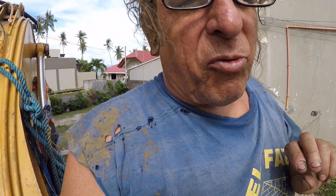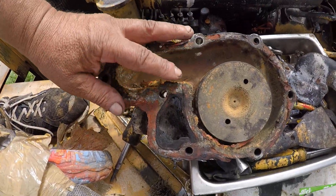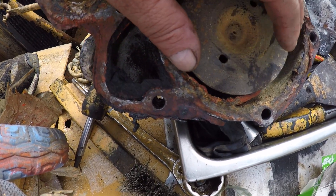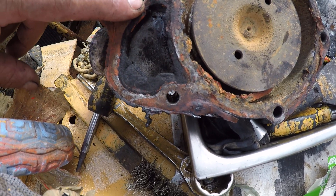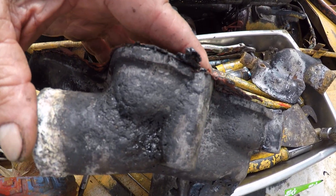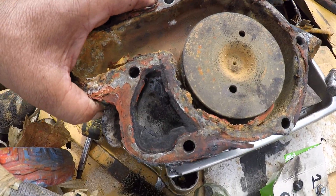This is a brief synopsis for the owner of the machine — everything I did to the front of the engine over the last week and why. There was an oil leak, and then there was a water leak from the water pump into the engine crankcase. The water pump had no paper or cork gasket on it, so water was coming out of this housing jacket into the bolt holes and going into the crankcase because the bolts go into the crankcase.